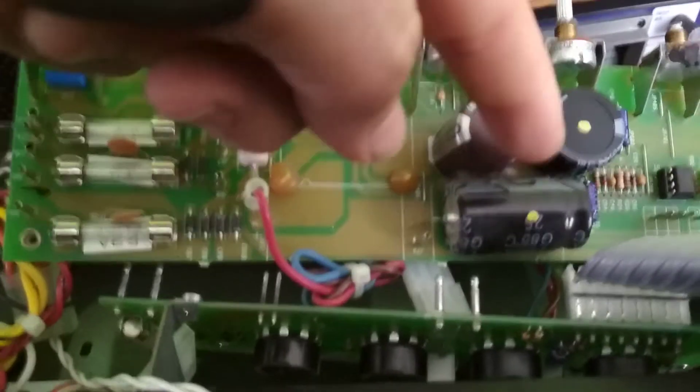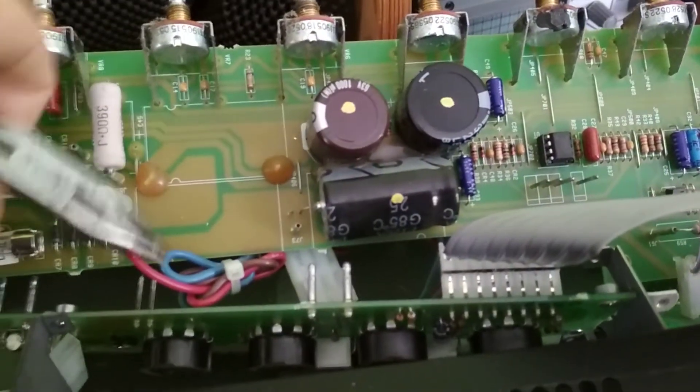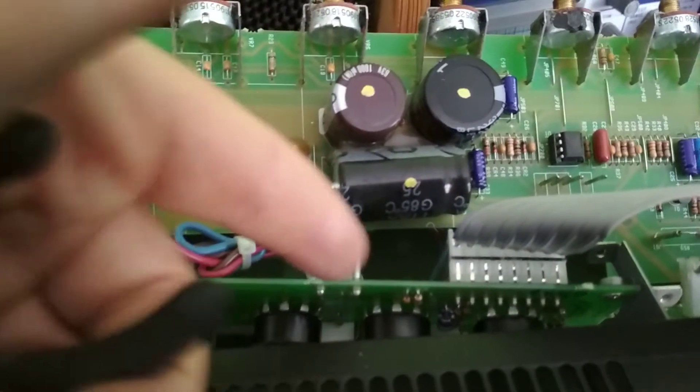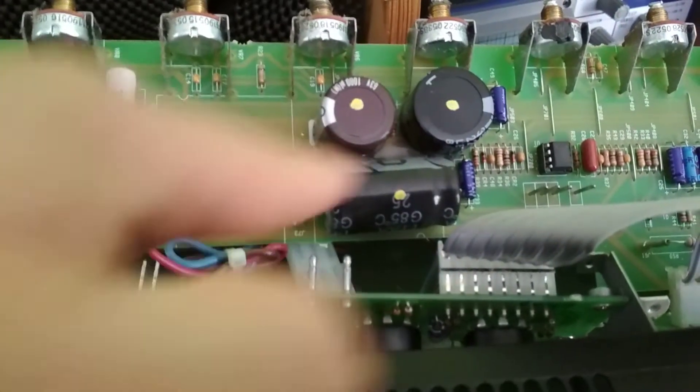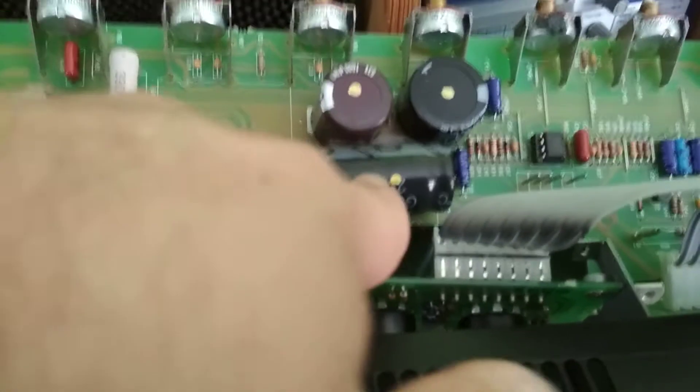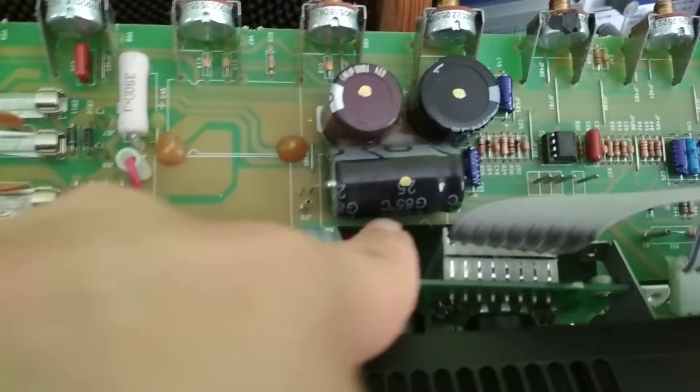It's that easy. So I'm going to go ahead and replace these 450 microfarad capacitors with brand new ones. Handy tip: don't be afraid to snip the ends off, but don't do it until you have discharged the caps. Get your multimeter out and put it on either side of the terminals and measure the voltage — these have like 0.014 volts left in them, basically nothing. Do that first before you touch them or you will receive a fatal shock. And when I say fatal, it is death — no maybes. It's seriously hazardous.